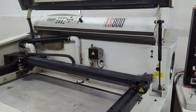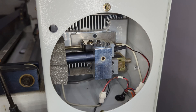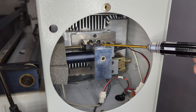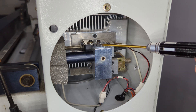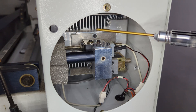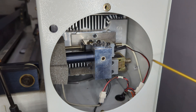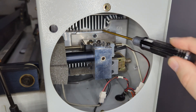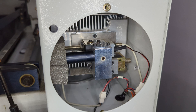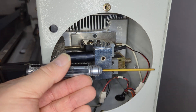The other one is the mirror in the back here. So here we are at the back of the machine. There's a disc on top here — that particular one is where the first mirror is mounted to. That disc can rotate a few degrees by loosening off these three screws around the outside, and can then rotate to go forward and away. On top of that you have one here, one in behind, and one at the front, which will rotate the entire assembly on that axis.